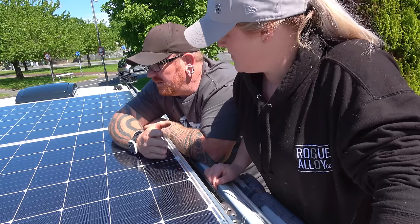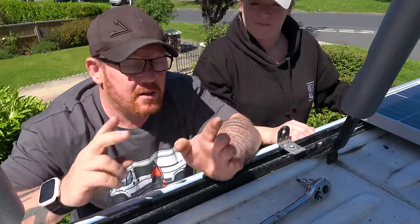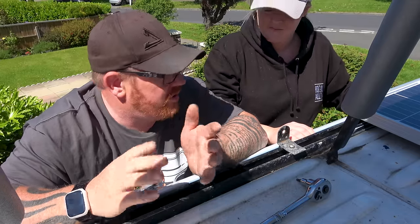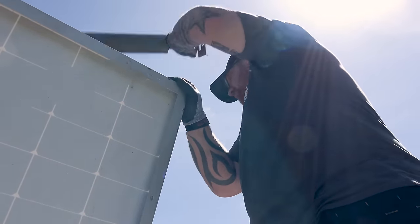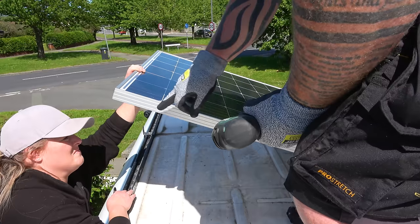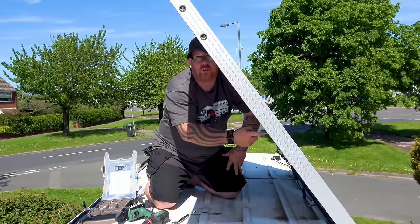So we know that both panels are in alignment. We secure our solar onto the side bracket here - we've got two on each panel and we're still going to keep two on each panel, mainly because the linear actuators are good, but purely for security and safety with sidewinds and things like that we just think it's better to have two. We've got all the original brackets. Now we just have to fix these two panels together, then do the same on each line going through - get about six bolts in there, four bolts each side.